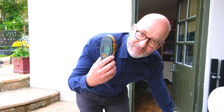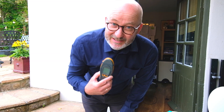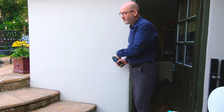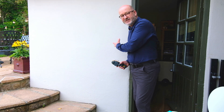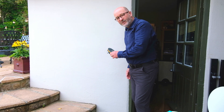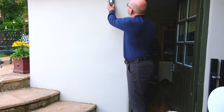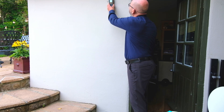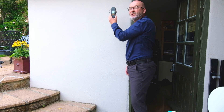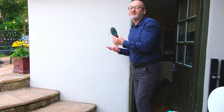So let's take a look at an example demonstration wall. This is a single brick cement rendered wall with paint on it. The first thing we do is a sample test to see where it's driest — and that's my dry zone section. Now all my readings are taken from that.